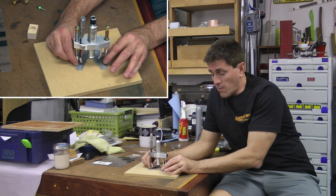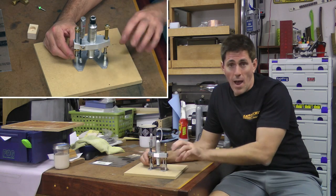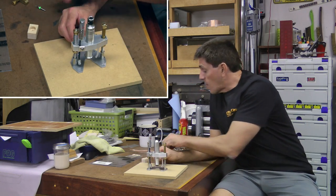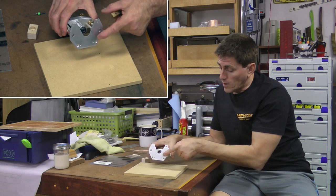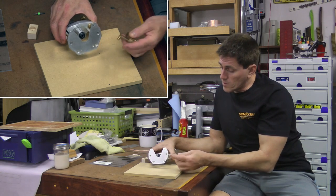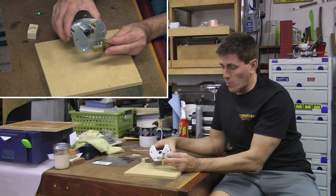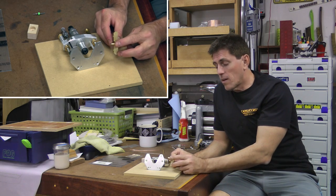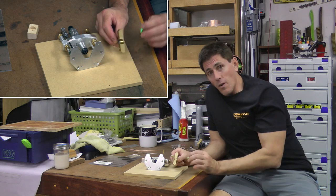Now a problem with this is it's great for freehand routing. But I need to follow a curve — specifically a patterned curve for making a small escape hatch in the back of my entertainment center so I can stow wires. So I can't follow a pattern with this as-is. Now there is an accessory for this router from Stuart MacDonald that attaches to the base using two threaded holes. The two inside holes come with the base; the two outside holes are ones I added for a separate jig we'll talk about in another episode. That accessory attaches to the bottom and allows you to add an offset from something you're following to where the router bit is located — much like a router bushing or guide for following a pattern. But the problem is that this follower is much too long.